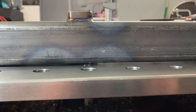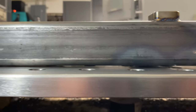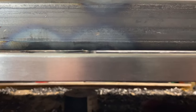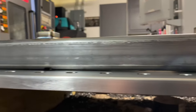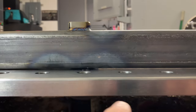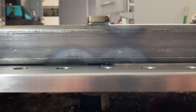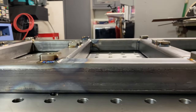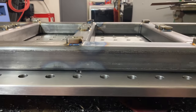Right now, after heating it, it's really hot. It's raised up a lot, but that should come down pretty good. Now, when this tubing is actually flat, I will still have a little bit of a gap here because this plate is slightly bowed in the relaxed state. But I'll check the tube with a straight edge. But man, should have left it alone.